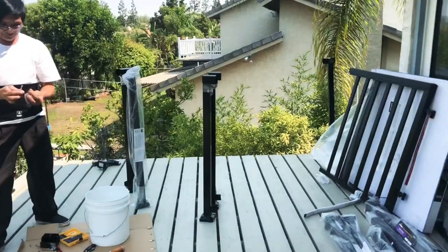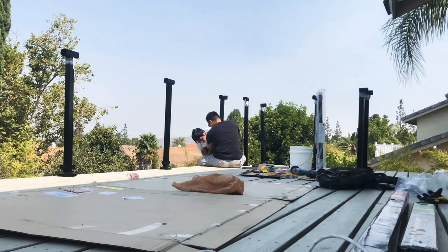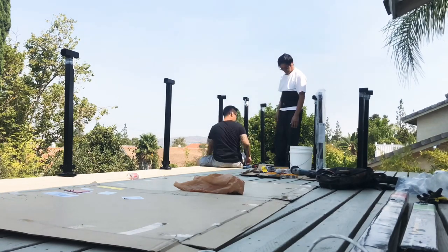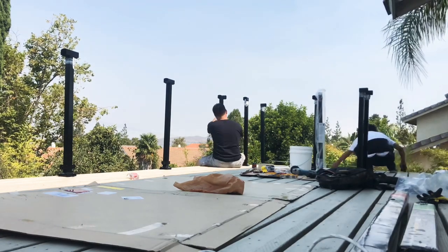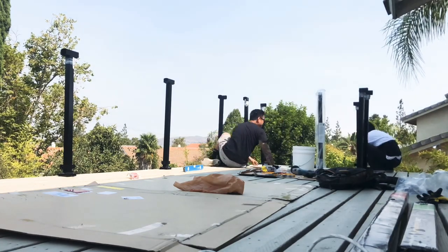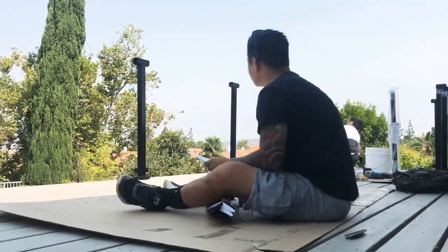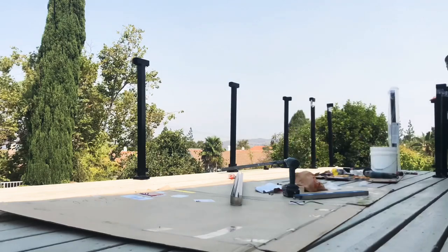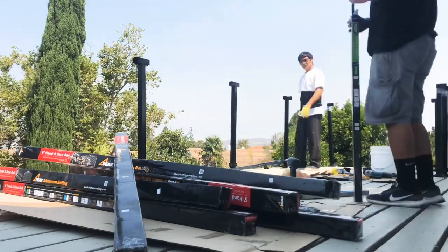We've never dealt with this railing system ever. The post is up, just gotta put it all together. Starting it off - securing this post first because it's where we're gonna start, leveling it, adjusting it, putting it up and down, shimming it through. It has to be leveled straight up because we got glass on this too. I started just reading - read everything before you put it all together. That's how I conduct my business.